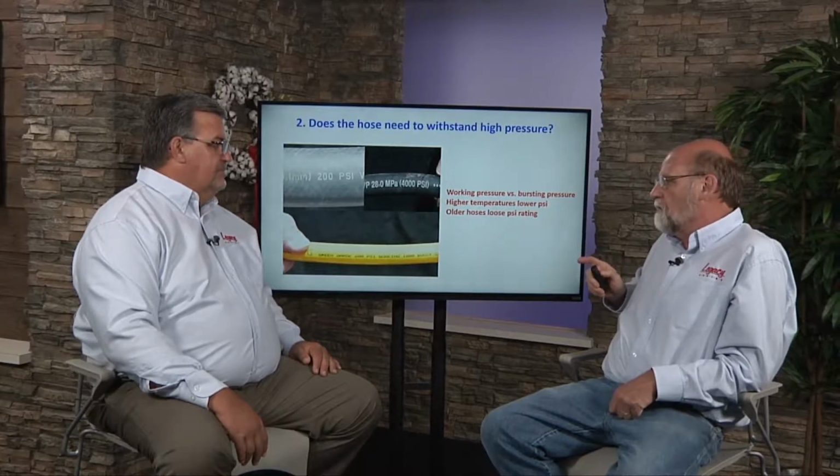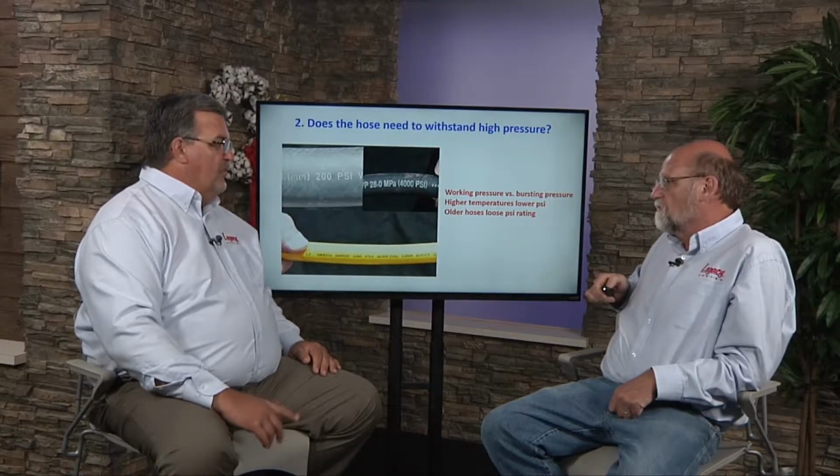The second most important piece is what's the pressure it's got to withstand. I think you were saying on your spray that you've got for your crop, you're looking at, what did you tell me, 30 to 70? In our application, we're looking at pressures between 30 and 75 pounds per square inch. But here's obviously a hose that's going to carry a lot more pressure, probably a hydraulic hose, 4,000 PSI. Yes. And obviously then, wouldn't one be more expensive? 200, 4,000. Wouldn't you think there would be a difference in the hoses and ability to hold that pressure? Yeah, whether you want to be broke down once or twice.